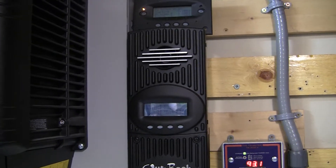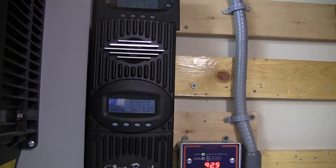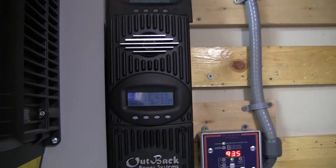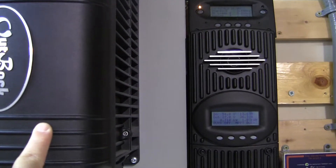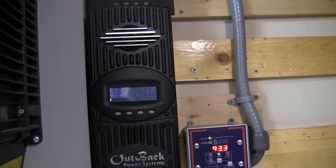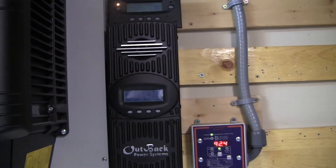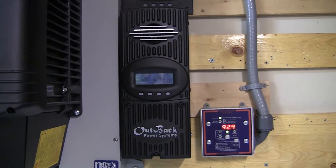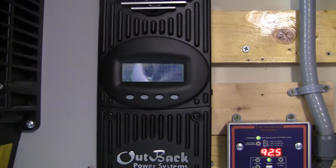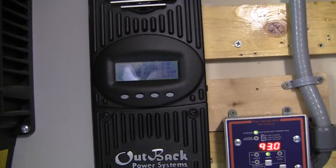So I have to do some more homework and figure that out. The second issue is that I have 5,200 watts of solar. Even though I have two inverters, each inverter can only charge 2,400 watts total — that's 400 watts more than what these inverters can handle. So I may have to actually separate out the strings themselves. It's about five or six hundred dollars more than just getting four new panels.